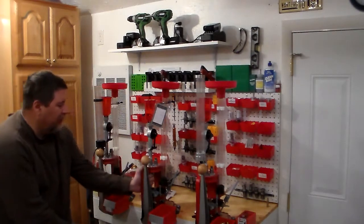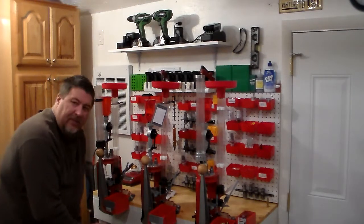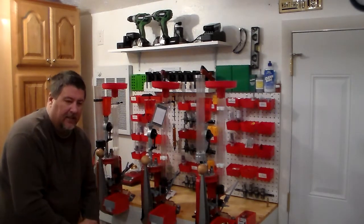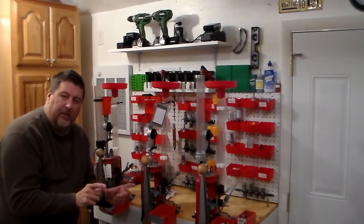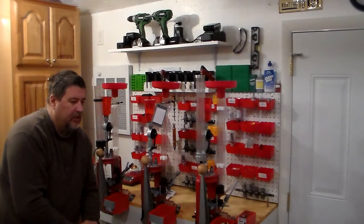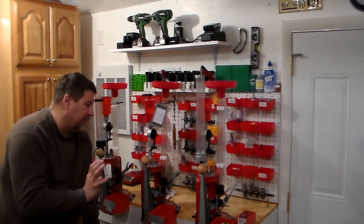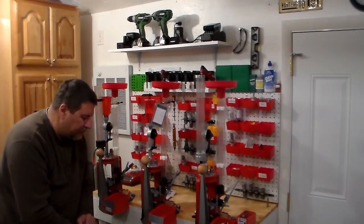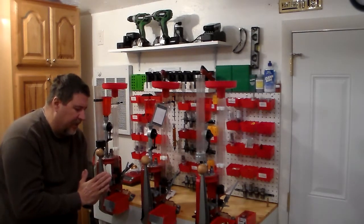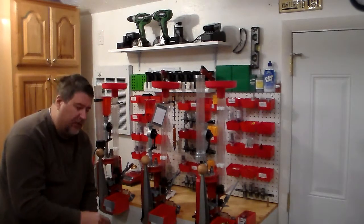Questions have come up about how I build my benches — you can grab and pull these presses and you can't move them. I use two-by-six wood for the framing, put a backplate across the back using screws normally used for porches and patios, about six inches long with a pretty good size head. Then I build the frame, put my legs in — two of them together — and in the middle I use lag bolts that go through and down into the floor.